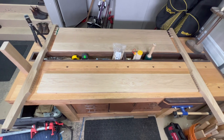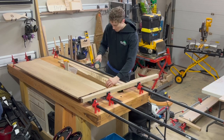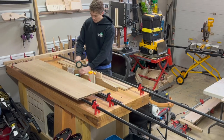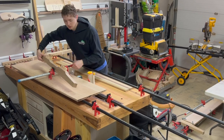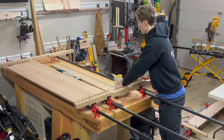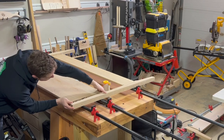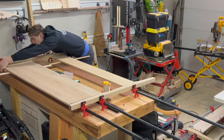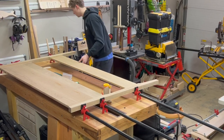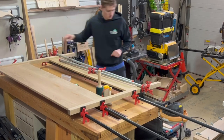Here's a picture pre-glue-up of the headboard. You can see I have three longer clamps — each about nine feet long — so plenty of space for my 66 inch wide headboard. This was a pretty big glue-up, but I'd done one before so I knew what to expect. I made sure the dowels on both feet pieces were already in, then lined them up and slowly started tightening all the clamps. As I tightened, the board below kind of bowed under the pressure, so I added clamps on top to even out the pressure.